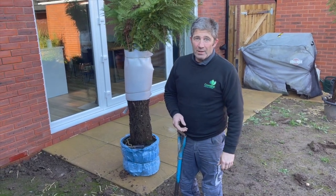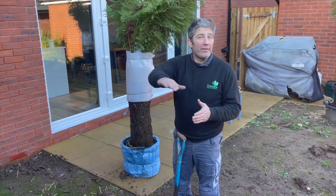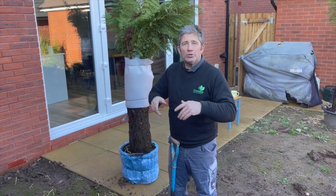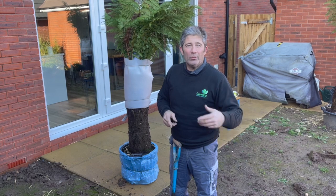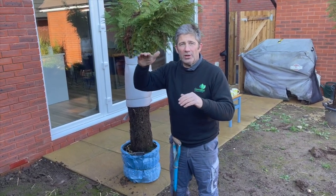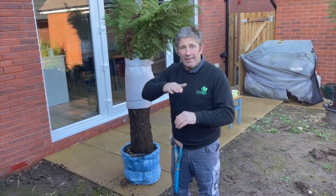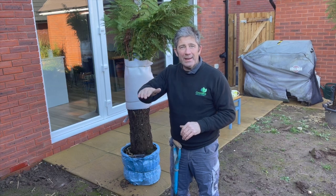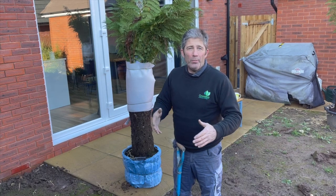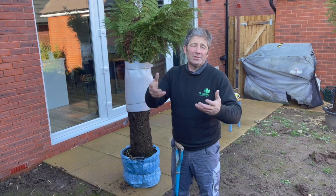Yeah, back home I've been on a few sites where they're going very deep. Sometimes if you get to the bottom of the foundation and it's still a little bit soft, because it's about getting down to the original ground level, what they call virgin ground, and you had the odd soft pockets where the ground was undulated, they would take that out. Before they used concrete, they would put lean mix in. A lean mix would dry quite quickly and stabilize the ground, and then you could put a pour in. Sometimes you could put steel in, or sometimes they didn't. And of course, these days they've got fiber.